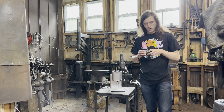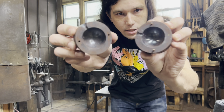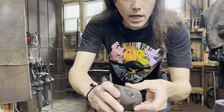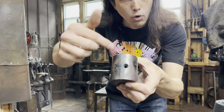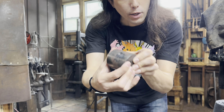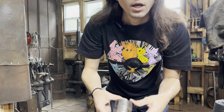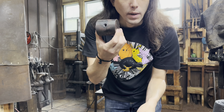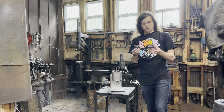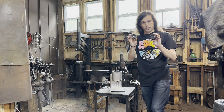We've got our lead melting in there, so while that thing is getting hot, I'm going to talk about our cannonball mold here. This is our 38-millimeter cannonball mold. It works just like this — you put the two halves together, clamp it together, and pour our lead into the mold right here in this little hole in the top. You let it cool, open it up, and you get yourself a nice new shiny cannonball. This was made by a guy named Larry Callahan — his website's bagmolds.com, I'll put the link in the description. Super awesome company, happy to make these custom for you. This was custom-made for us by him.